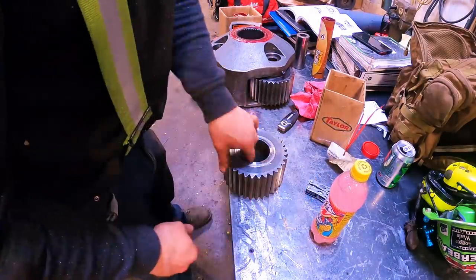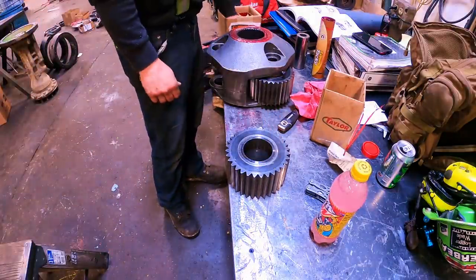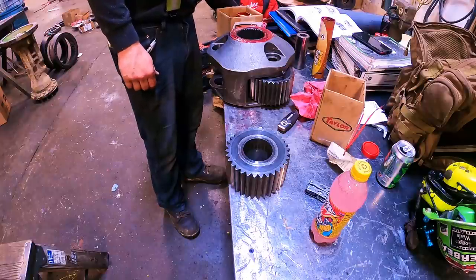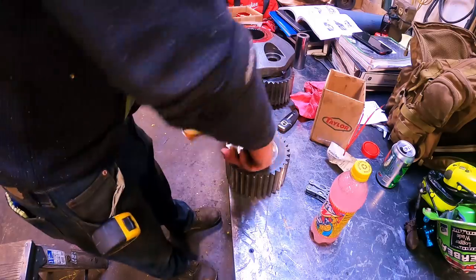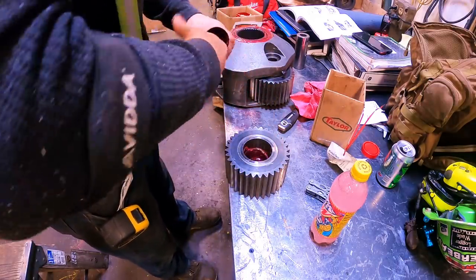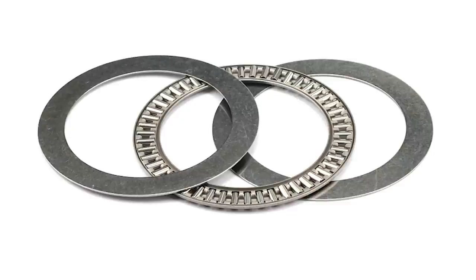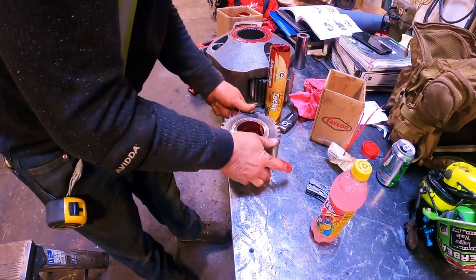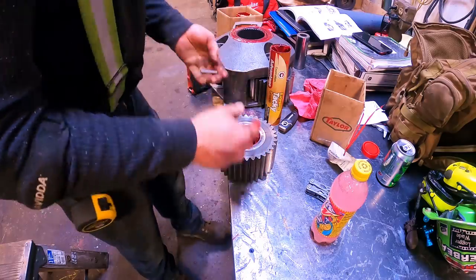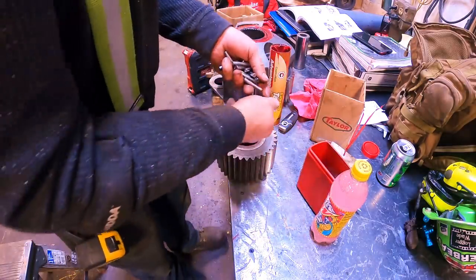What we're doing today is we're getting a little farther along on this John Deere Teammate 4 14,000 pound axle. I have not been covering it real well. What we've had is the Diffy Lock thrust bearing go out of this thing and eat itself and eat a bunch of stuff up in this rear end, because we'd actually run it probably too long. That's probably what we've done here. Once the Diffy Lock quits working in these Teammate 4s, it's probably time to shut her down and do something about it. It's not like the old axles where you just got Diffy Lock problems, pump problems, you know. So that's kind of what's got us into this.